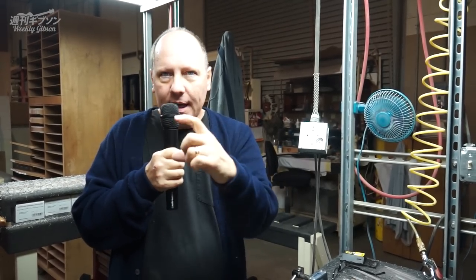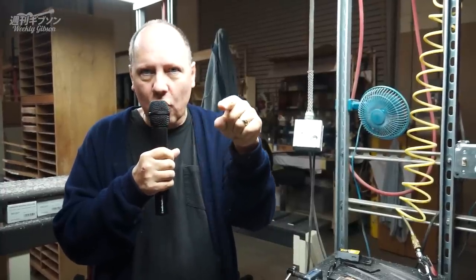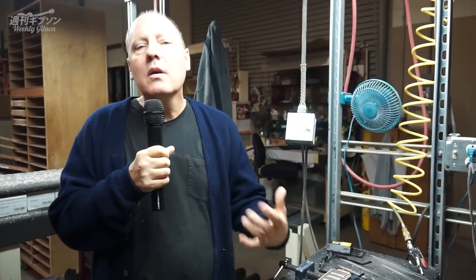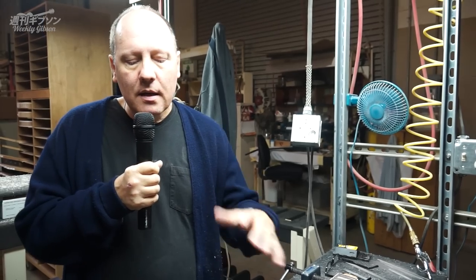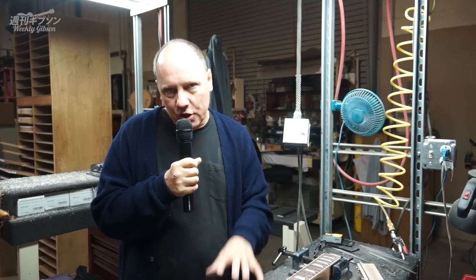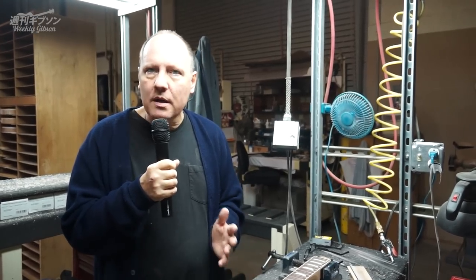So if you look at a section of a neck, from the bottom, it starts almost as a circle, and comes up almost as a circle, all the way past the top edge of the fret. That's for comfort of playing. So, in order to accommodate that same feel, what we've done this year is we have started rolling the binding on True Historics, but we do it when the neck is not in the guitar so that we can get the entire neck, and it's easier for us than just doing the fingerboard. So I'll show you some of the process that we use for doing that.